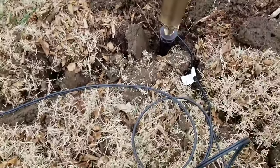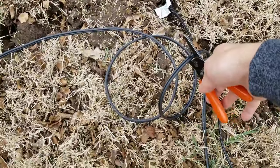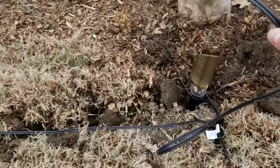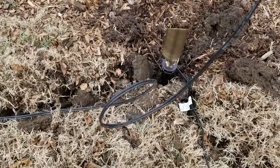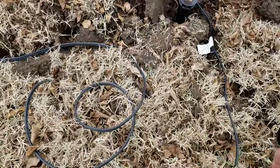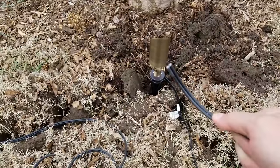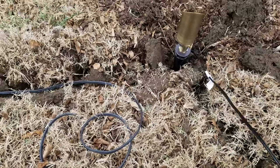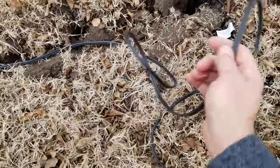But if you notice it's not cut — it's just the main wire. So what you're going to have to do is cut it. So you cut the main wire. Now you have the wire going from that light to give it power, you have the main wire coming from the transformer, and then you have the wire from the light itself. So you have three wires.